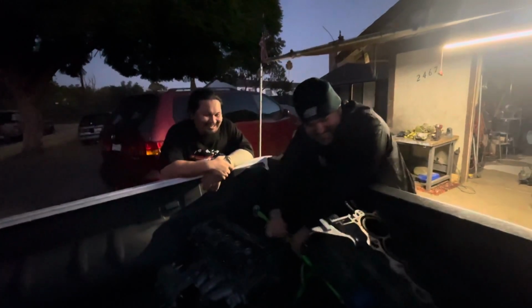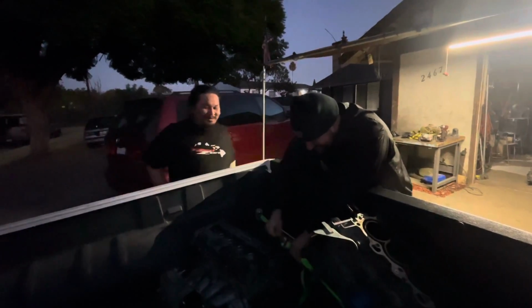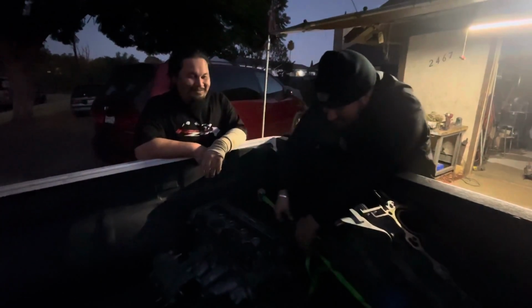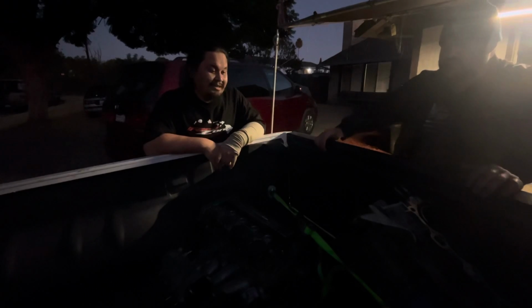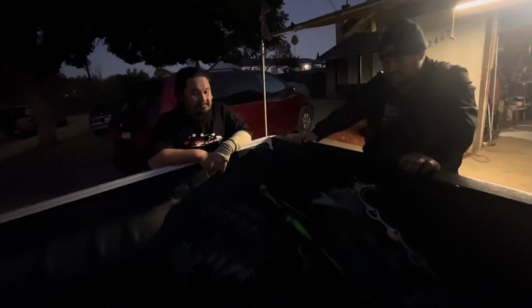One very dead cylinder. Yeah, 100% leaked down. It was leaking down so bad, it was coming out of cylinder one. Then we ended up finding that one valve that was like half missing, burnt out. The block is still good. It ran fine. It didn't overheat whatsoever. We just have a pretty badass Colorado.